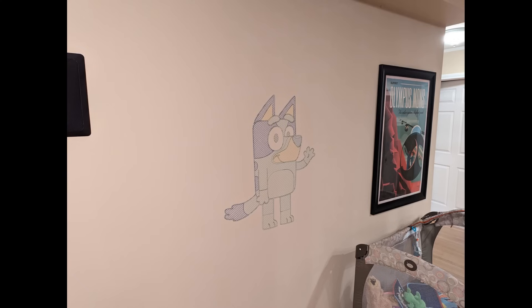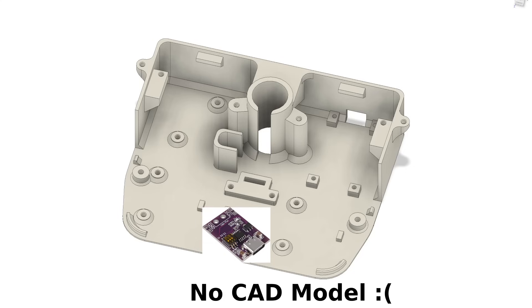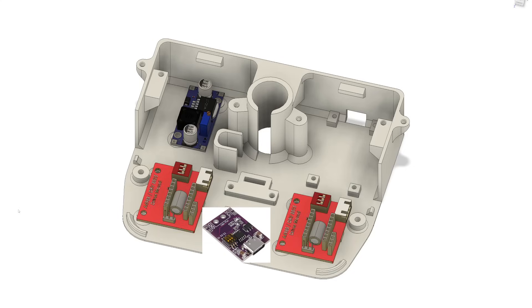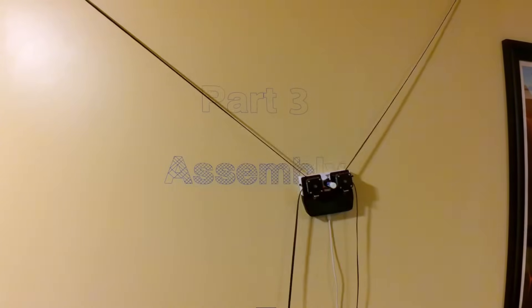You can see how repeatable the movement is here, where each color was drawn in its own run. That took me two years to get to, but let's skip over that and get to the final product. We're going to use a USB-C power delivery board to get 12V from a USB-C power supply, and a buck converter to step that down to 5V. Then we have two stepper driver boards, a servo to move the pen up and down, an ESP32 microcontroller as the brains of the whole operation, and on top our pancake NEMA 17 stepper motors. Not a ton of parts, and the assembly should go pretty smoothly, so let's get to it.